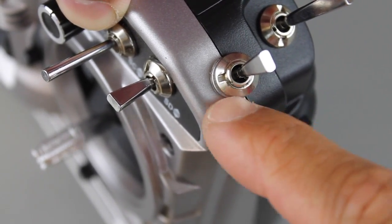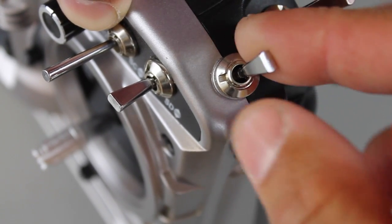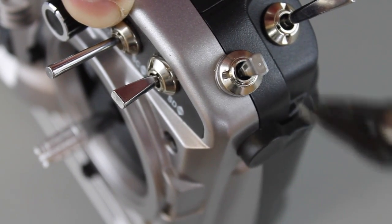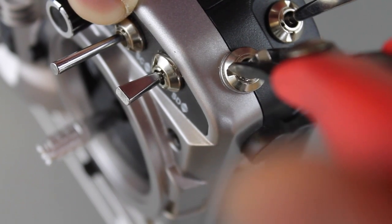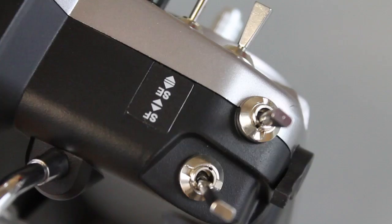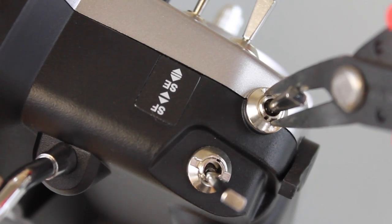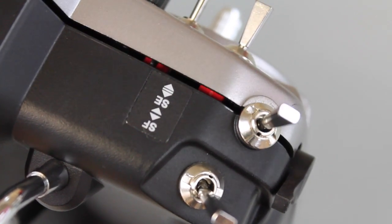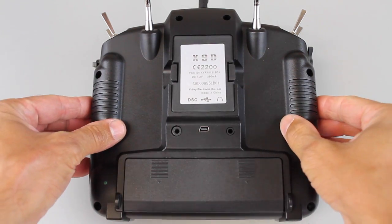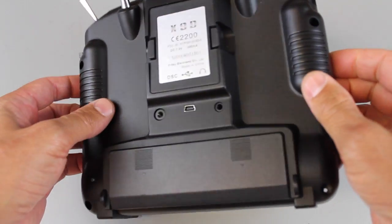What you'll need to do is loosen — basically this is a nut that sits around that threaded post. So I'll go ahead and put the switch in the middle position, and you'll notice there's a notch on each side. I'll just use some needle nose pliers — you'll need some real thin ones — and just loosen that a little bit. I'll do the same with SE: put it in the middle switch position, get my pliers right in those notches, and turn it a little bit. That's a key step. Originally I got the screws out and couldn't figure out why the back wouldn't come off, but now we should be able to just open this up.